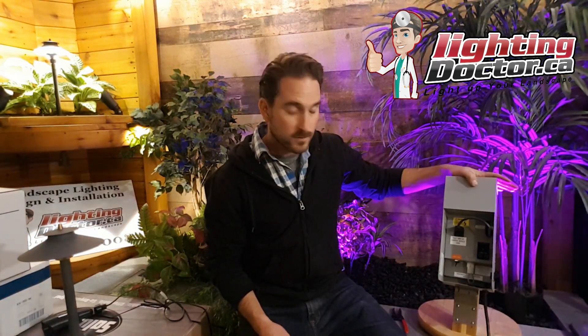That's why when we sell our premium kits with 20-plus lights, we usually upgrade to a slightly larger transformer — like this 150-watt unit. It has a slightly larger terminal so it gives a little more juice, and the terminals are big enough to fit two wires going out in both directions. That further eliminates voltage drop. With a 15-volt tap you can lose up to 6 volts along the line and still have your lights run optimally.